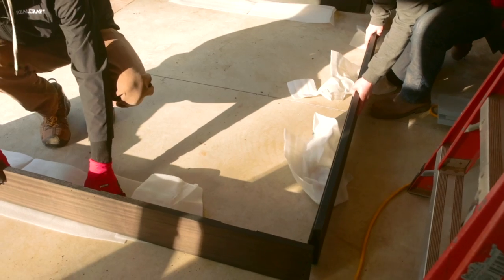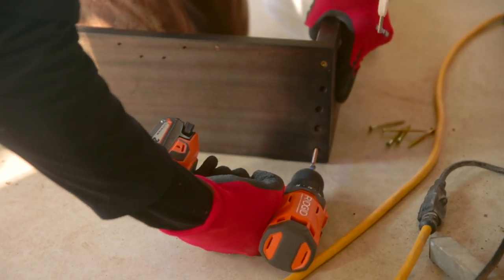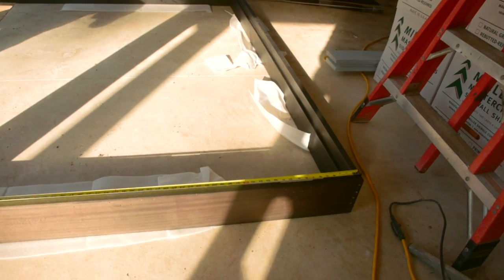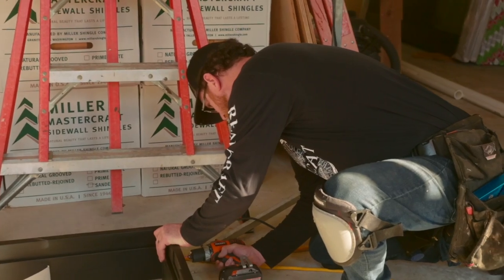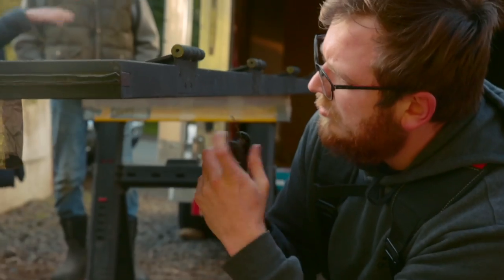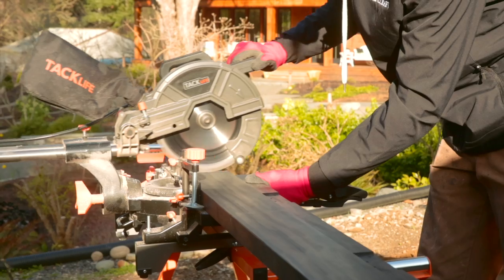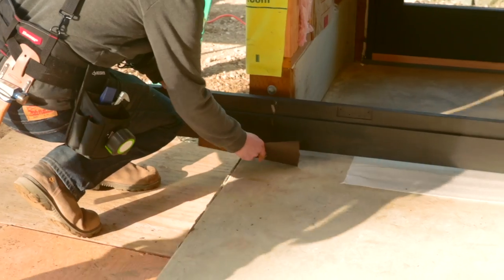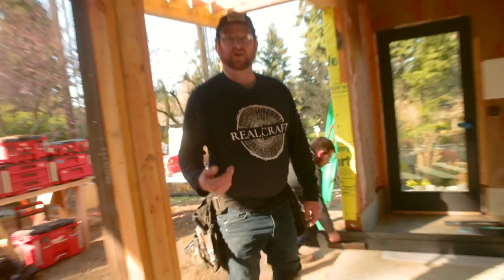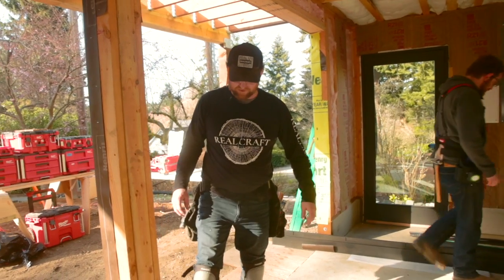Here we are assembling the jamb on the concrete surface. To protect the jamb, use the provided foam to keep the jamb off the concrete — it just helps the overall quality. The tar paper prevents moisture from wicking up through the concrete into the bottom of your freshly cut jamb leg.